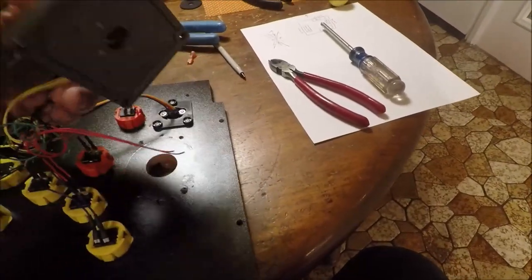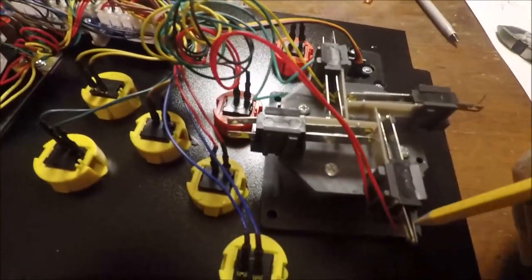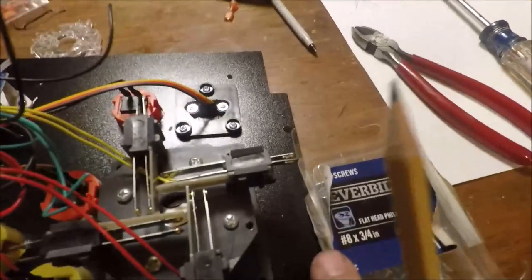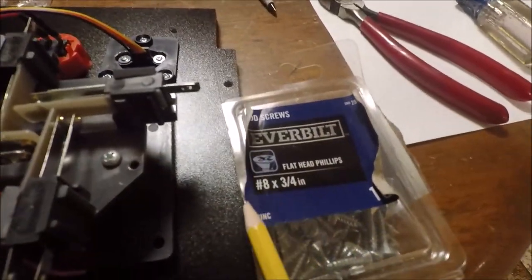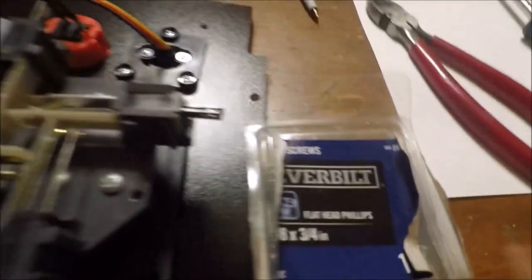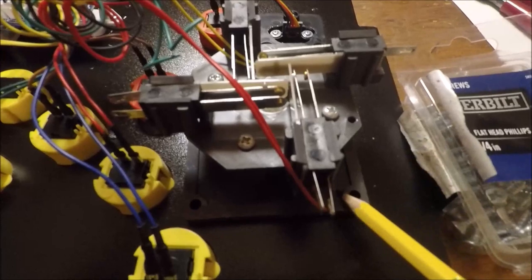Here's the new joystick — you have to take it apart to put it down. I'm going to center it over the hole exactly where I want it, then take a pencil and mark the holes. Then I'll drill with a pilot drill bit, which is just a little bit smaller than the wood screw I'm using. The screws are number eight size, three-quarters of an inch long, Phillips head wood screws. Then screw it down.